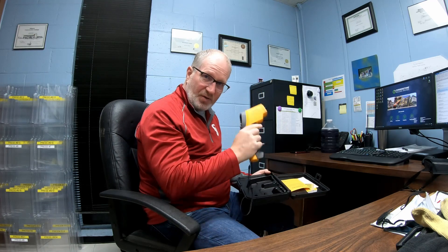Let me turn the camera around and show you the different instruments we have here. This is one type, and this is an old-school Fluke — it's a laser reader. You shoot a laser beam and get the surface temperature of the mold, or you can purge material out and put the gun right into the material to get your barrel temperature. I don't really like that method — it's not as accurate. Definitely want to use PPE: hot gloves, sleeves, glasses — make sure you have everything you need.